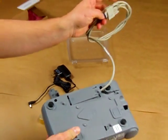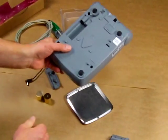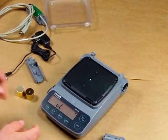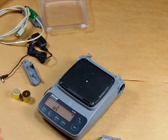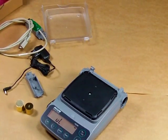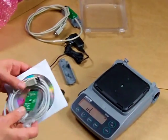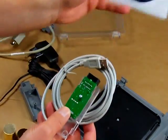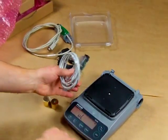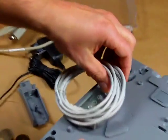You would be responsible for purchasing your own software; you can also find free data acquisition software online. Another option is to purchase the scale with a USB interface instead. Many newer computers don't come with an RS-232 port but do have USB. With the USB interface, a driver needs to be loaded, and the module works the exact same way — simply turn the scale over and it slides right in.